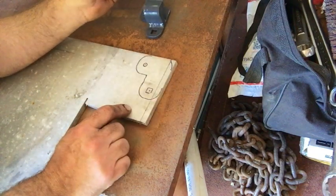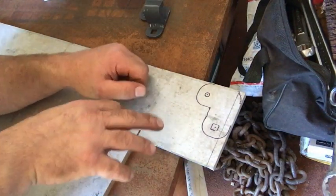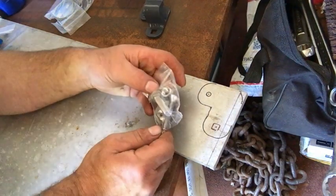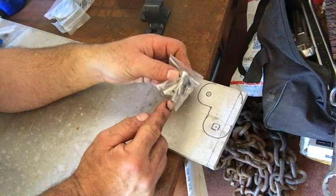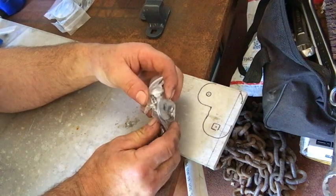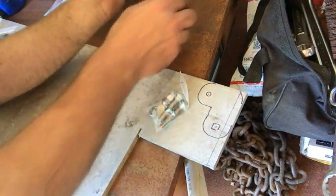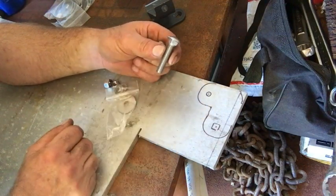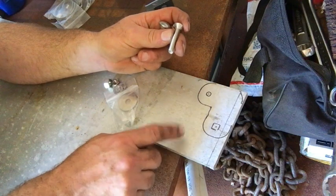I have a three-eighths-inch-thick piece of aluminum plate here. I've traced the base of the bracket onto this plate. I'll drill these holes first — I have a lot of material so I don't even need clamps. The hardware they give us is stainless steel, but I won't be able to use these because now they'll be three-eighths of an inch too short. I'll need to get two longer bolts: one longer carriage bolt and one longer tapered bolt to accommodate the extra width through the door.